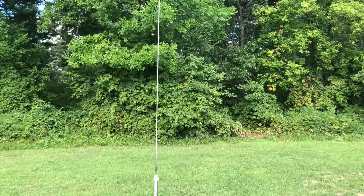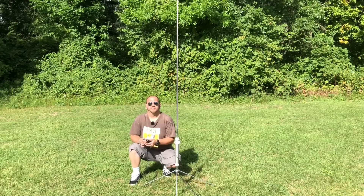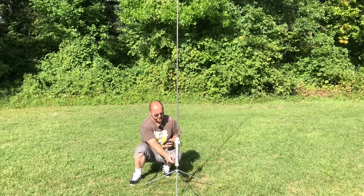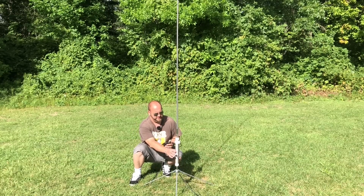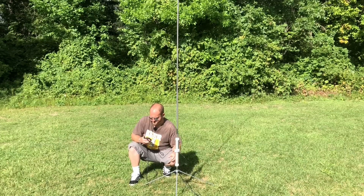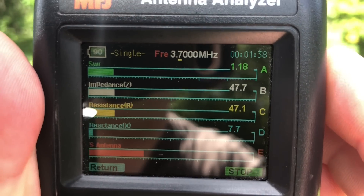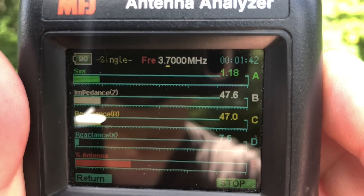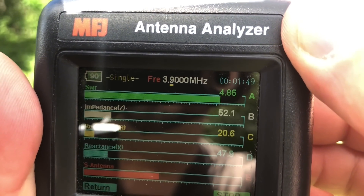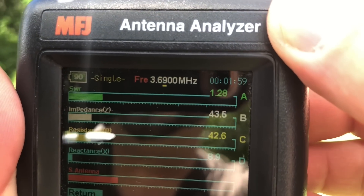This thing is big — like really big — it's way up in the stratosphere. Let's see how much less inductance this needs on 80. I've actually never tuned this up on 80 in this configuration, so I'm kind of curious. Usually the coil is down here; I would guess it's probably going to be closer to the center. Wow — that's pretty perfect! I just chose 3.7 MHz as a random frequency and got 1.18 SWR — it was actually 1.0 something. As you move away from the antenna it'll change ever so slightly, but it's a pretty big band so you'll have to tune it a little if you want to bounce around. Not quite as wide band, but still pretty good. It works.